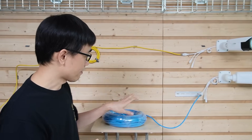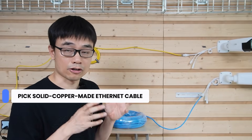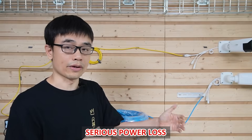Should we pick CAT5e or CAT6 Ethernet cable? It doesn't matter, since all the cameras just use 100Mbps speed — CAT5e or CAT6 doesn't improve the speed between the camera and the network video recorder. What really matters is the cable material. It's better to pick cable with solid copper. If we use CCA-type cable, we may face serious power loss in the long run.